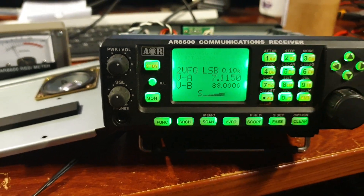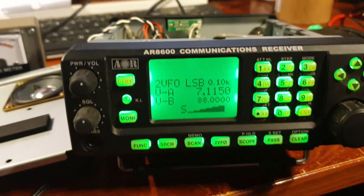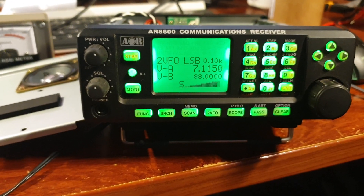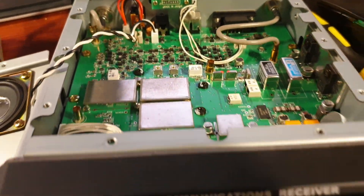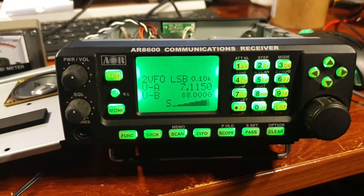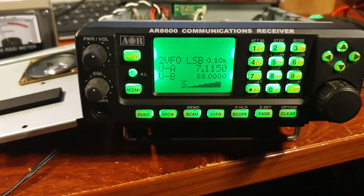Once Brian comes back, we'll just make sure we're 100% on frequency. This unit is kind of interesting — they actually run different oscillators for VHF, UHF, and HF. HF is quite an independent area. What you're looking at here is dynamically a lot of the HF filtering, which is done well — they've got a superb receiver. But if someone's got one of these and it's come in transit and it's a bit off, you can easily adjust it back up.